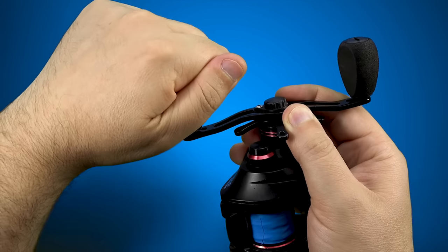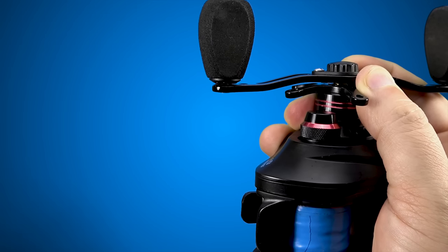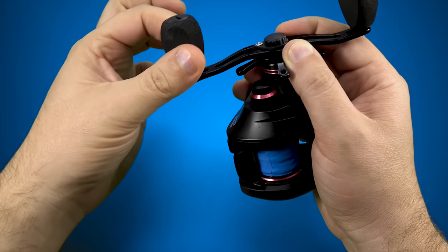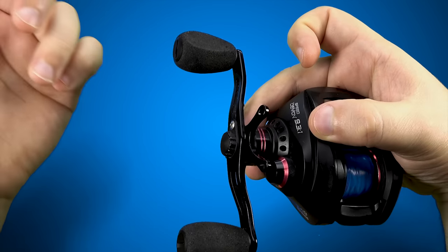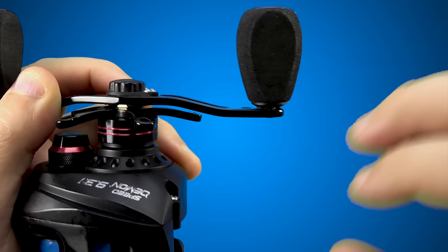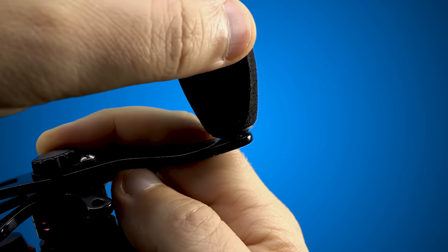One area I really pay attention to is the shimming of the handle knobs — it seems stupid, but it's the input side of the reel, the most tactile part, and you want it to be as refined and perfect as possible. If you look here, this knob is on par with a $600 reel. It's almost like a G3 Abu Garcia-type EVA knob — no hard edges, all the edges are broken, very comfortable. And there's no play at all, which is the whole purpose of shimming washers. See — perfect. And then tell me if you notice something: this one goes from four inches to the left, and it's like holy crap, that's awful. And then this one is perfect.